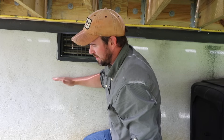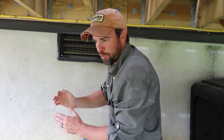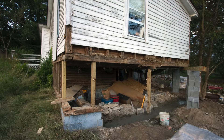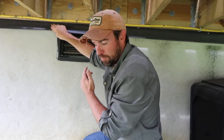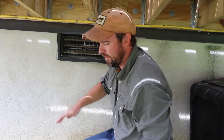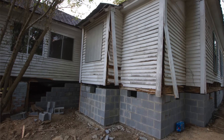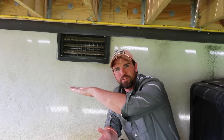We did this in sections, working from the front corner of the house and making our way back. To make sure this is level, we made sure the foundation wall itself was what was level. As we were jacking up the house — and the house is kind of all over the place as you do this — we were only getting it just about an inch above where it needed to be. What we made sure was level was the top of the foundation wall. We basically worked our way around the house, rebuilt the foundation a section at a time. It was definitely a lengthy, tricky process.